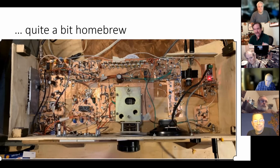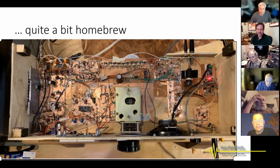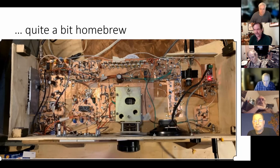Yeah, what I found was some of the extra crystals is what I use for my LO oscillator. Yeah, well, that's it. One of those additional crystals is down here, and it's the carrier oscillator and the BFO. I picked one that happened to be a little bit in the direction where I needed it, and then I put, I think, a coil and capacitor in there to move it to exactly where I needed it.